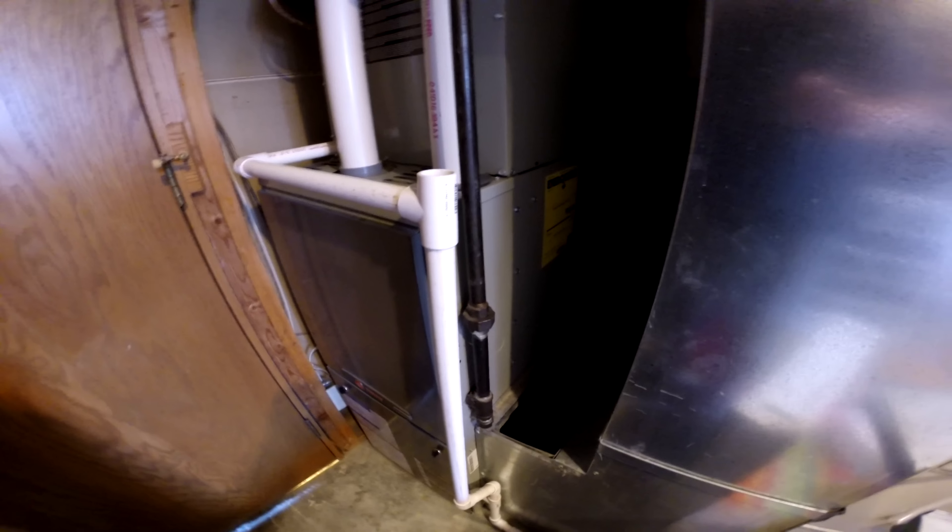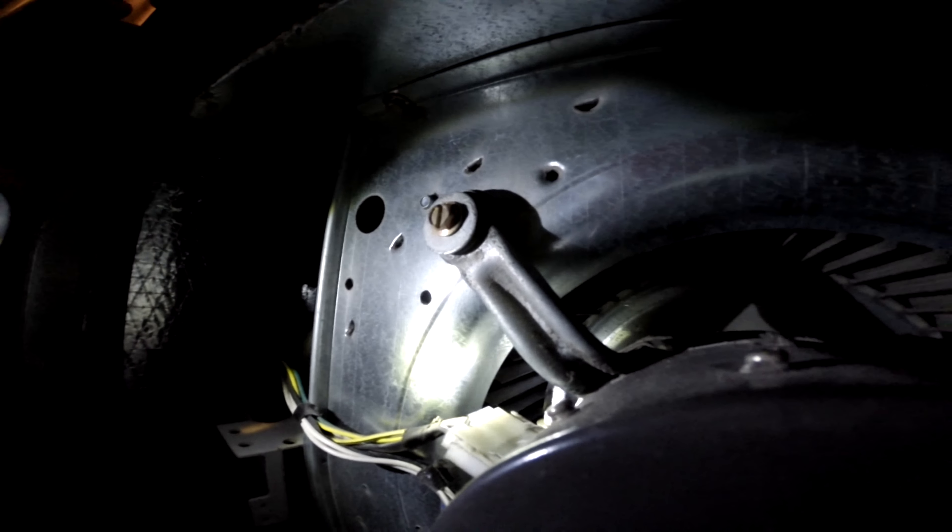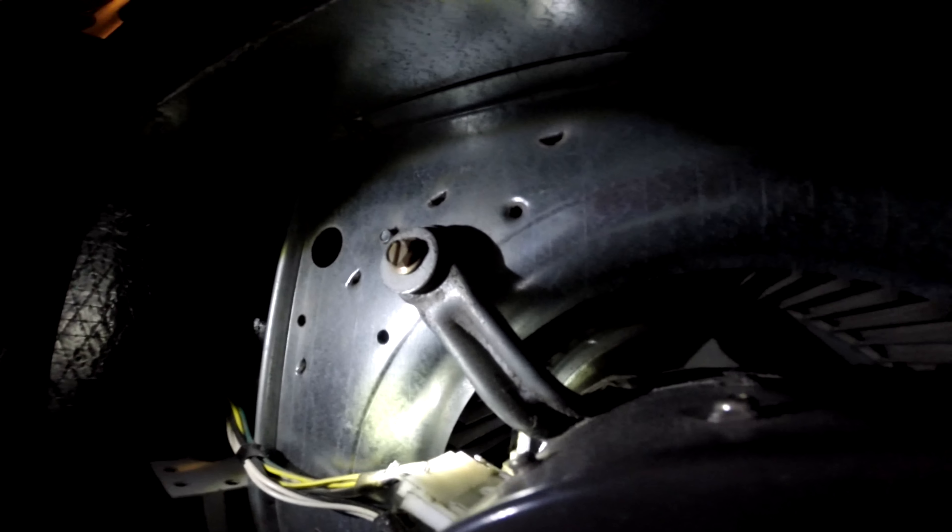I am going to take a peek with a flashlight. I'm going to show you another angle — that's from underneath. This is where the filter is sitting, and that's what it looks like inside your furnace. The air comes from inside your house, from your cold air return vents — the vents that have suction, they suck into the wall. That air comes in right through where the filter is, and then this motor pushes the air back through the heating part of the furnace. That's what the inside of your furnace looks like where your air is returning.